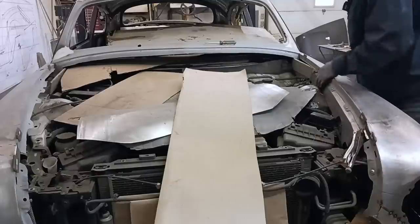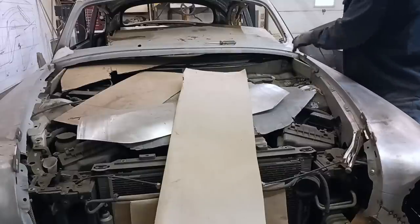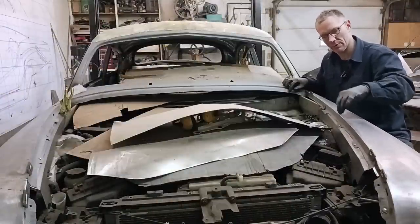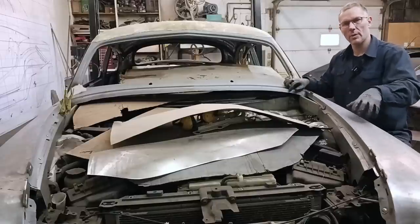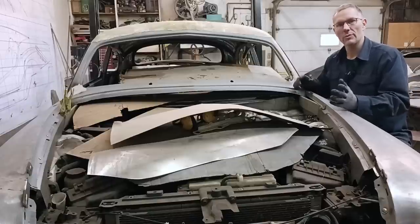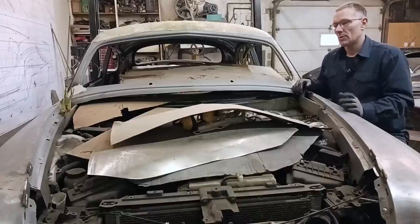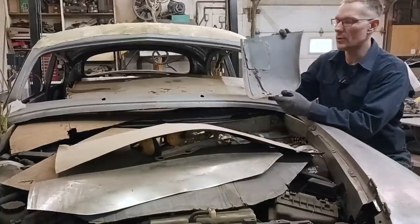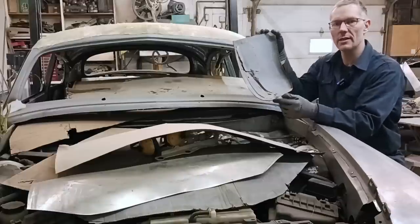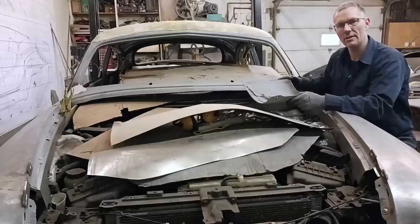Done. That blends right in. We can roll that down if we want to — streamline that. We will have to cap the top there because I don't want to see down inside. So we got the two inner fender structural pieces created and installed. I have to go in and tack them in a couple of spots on the engine side, then take the fenders off and do the final welds — get those flanges welded to the Infiniti's chassis. Then those will be solid enough that we can actually start bolting these fenders on and off without things moving around. We got the wheel arches reshaped — they're looking really good now, and they'll look a lot better when we drop the car. Next time, I'll show you how we go about recreating these structures for the fender heels. I hope you enjoyed this video — hit the like button, it helps us out a lot. Catch you in the next one, guys.